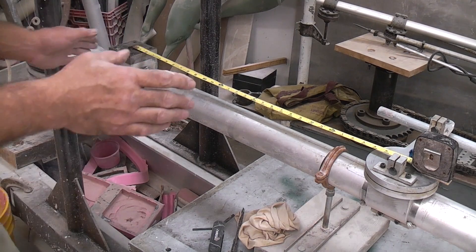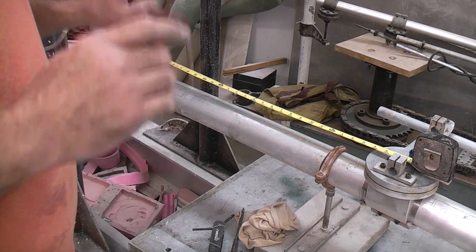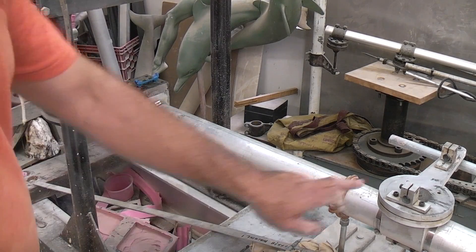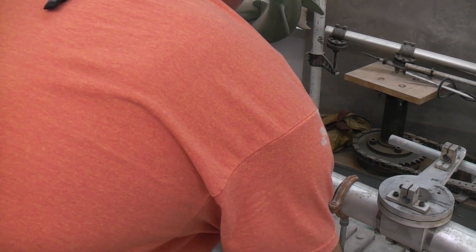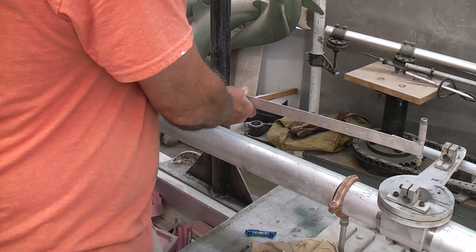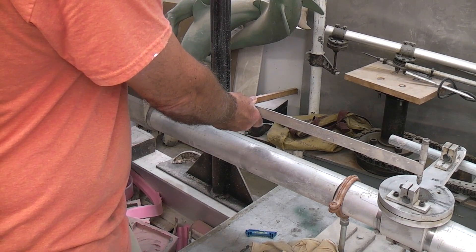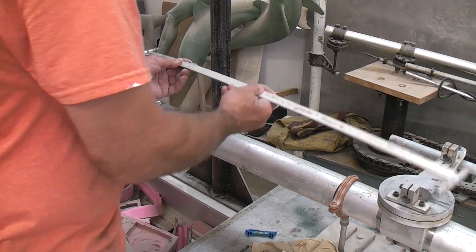Next I'll get my trammel points, mark them for 30.57, put those in there, and tighten it up. I've measured, taken my trammel points, adjusted them to 30.57 — it fits in there. There's a little point inside the ball socket which is really helpful, and that lines up — that's exactly 30.57.